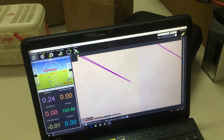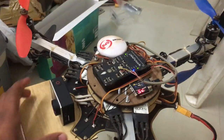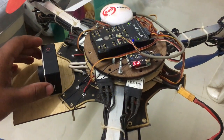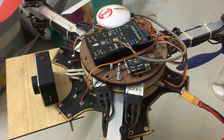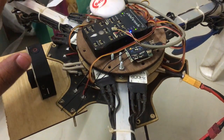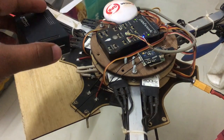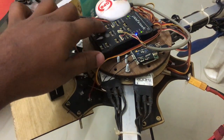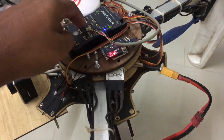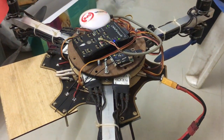Now for the geomapping, we have made a plate and we can attach a small form factor camera. You can use any camera that has a time-lapse or intervalometer function - Canon Powershots, smaller DC cams, or even a DSLR. To decrease system cost, we are using a small form factor camera. The Canon camera is mounted pointing downwards without a gimbal, since we only need the 90-degree angle downwards. We trigger the camera from the flight controller so it clicks images at a particular interval of time and data-logs the GPS and attitude data, so we can compile the data together to form a GeoTIFF image required for the 3D map software.